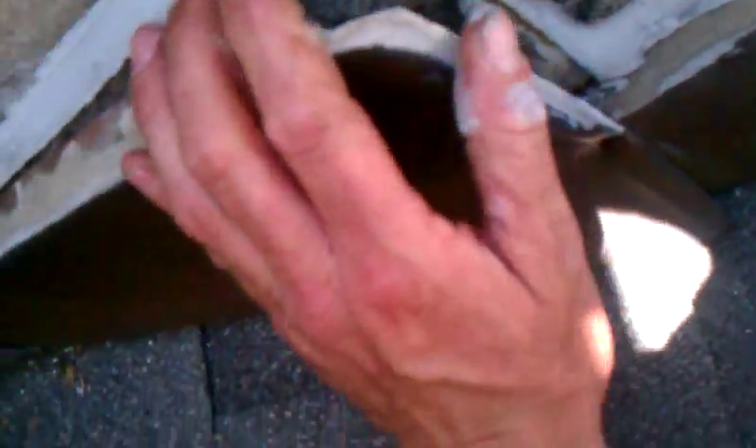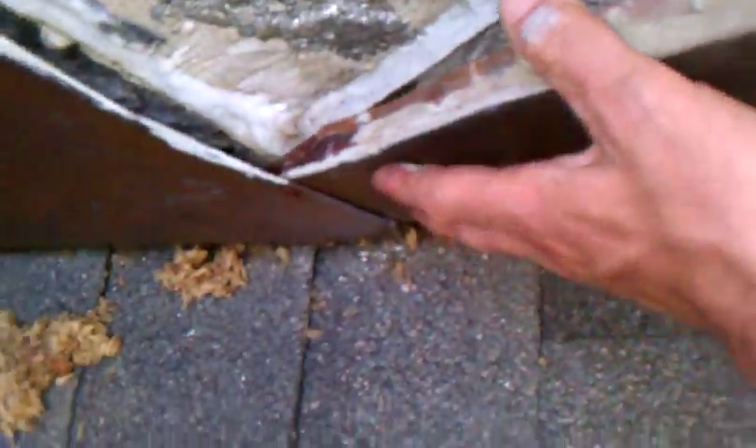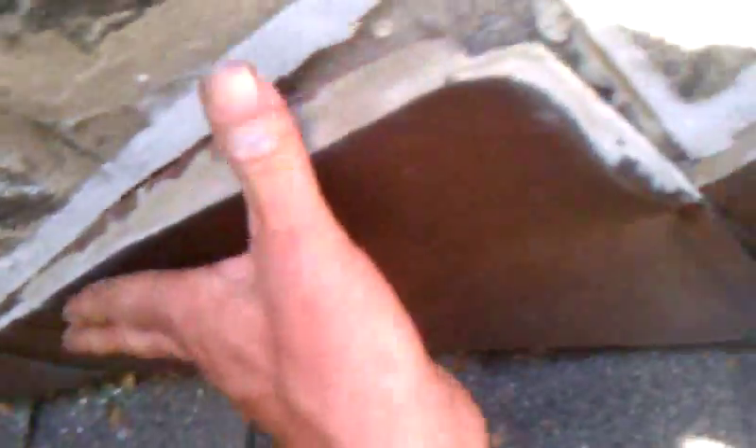It's wet there. There's no spring clip here, and there's no spring clip here either. When you cut a chimney in, you should always make sure there's a spring clip on your counter flashing — there's not one here.